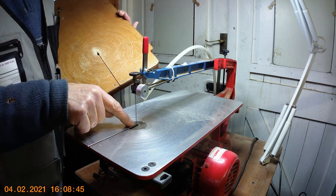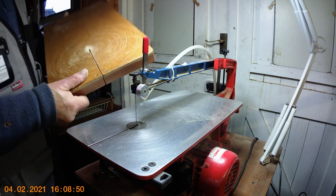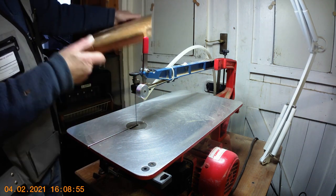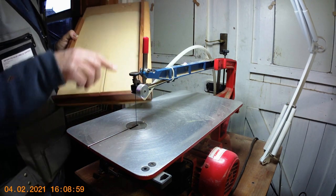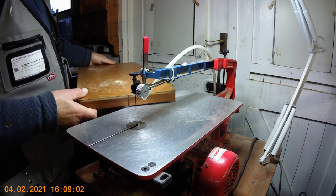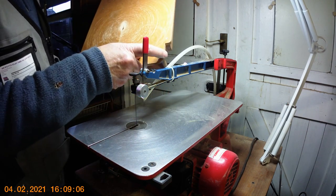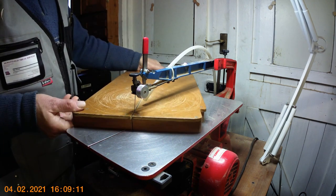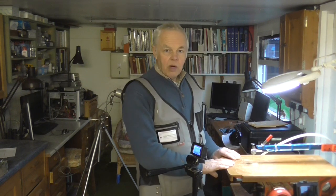The other advantage is you can have a much smaller hole here, which is important if you're doing delicate cuts. The slot on the original table is rather long and awkward, and for very delicate stuff it doesn't support the work at the back. This custom table solves that problem. It's only made from a bit of cheap throwaway MDF with little strips down the side to locate it. I've also cut away a little piece on the edge to accommodate the blade-changing block, so it just drops on.